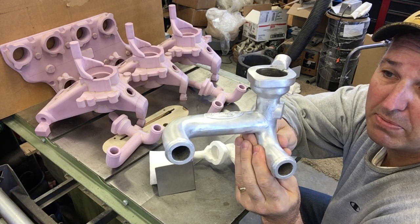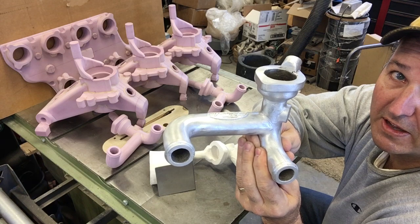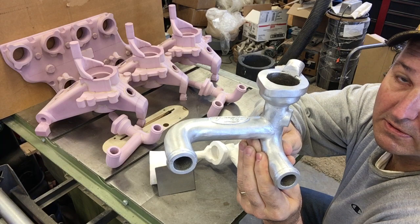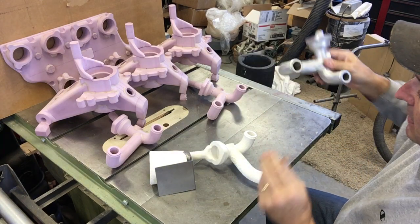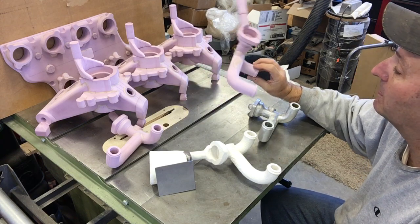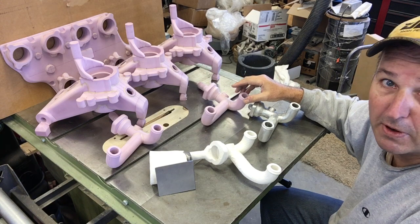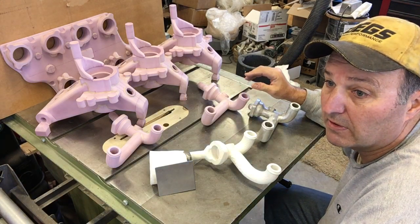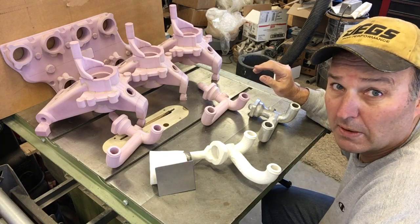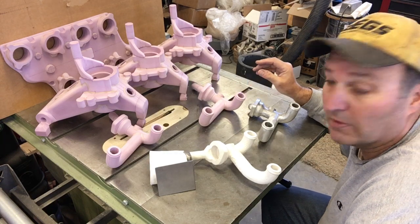There were just a couple of little pops of flame, and I'm going to see if I can't eliminate that altogether and get everything to vent through the coating, which is just drywall mud. You can see I've got quite a few foam patterns sitting here. I've got a few extras that I haven't coated yet, so I'm experimenting a little bit with different coatings and different degrees of permeability. I have some commercial lost foam coating, refractory material, but right now I'm just using drywall mud.